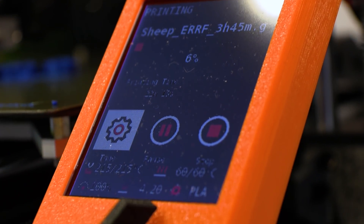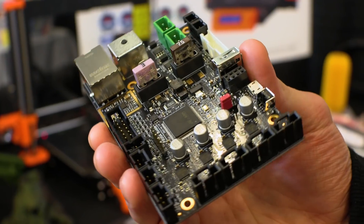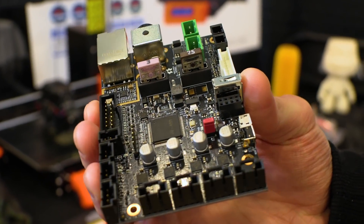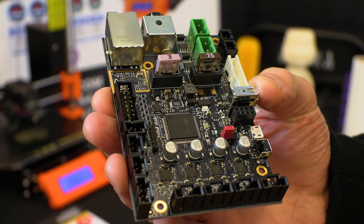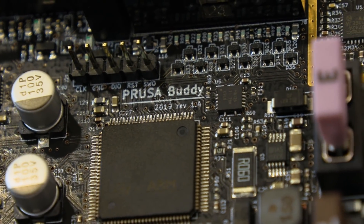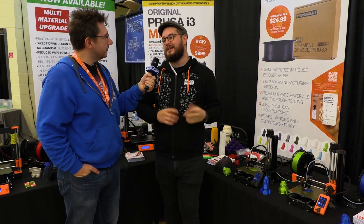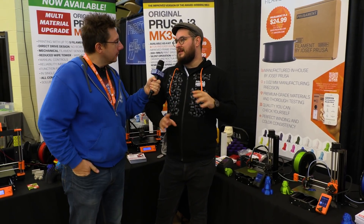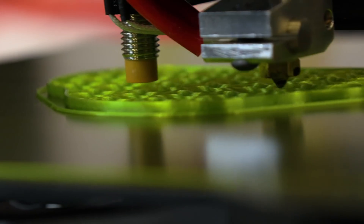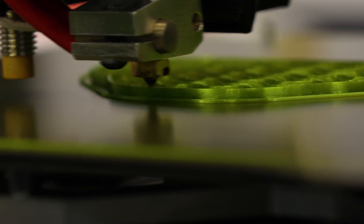This is our first printer running on 32-bit. We chose STM because ST has offices in Prague and they are doing ARM support for STM32 from those offices. They have many of our printers and are very excited to work with us. We also use the new Trinamic 2209 drivers, which are the latest and greatest. So the movements are silent on this — it's the best of the 2130s and 2208s. Trinamic is really thinking about 3D printers, and these drivers are very well-suited for this use case.